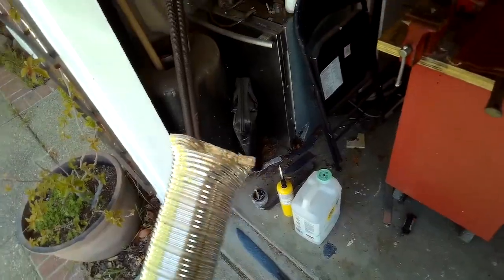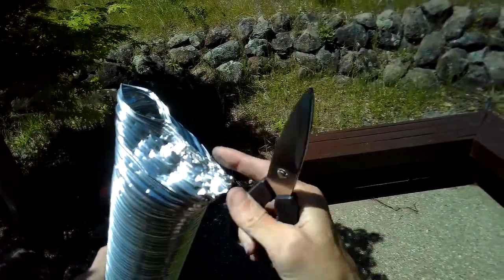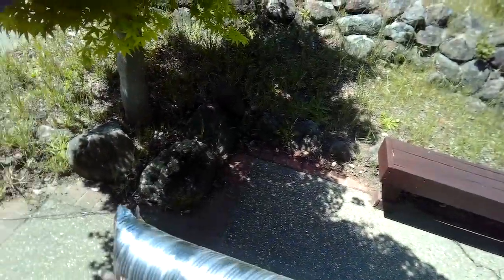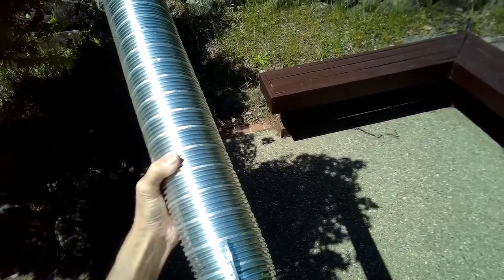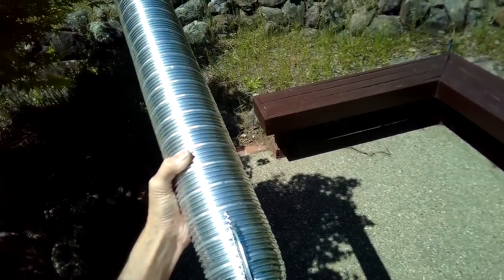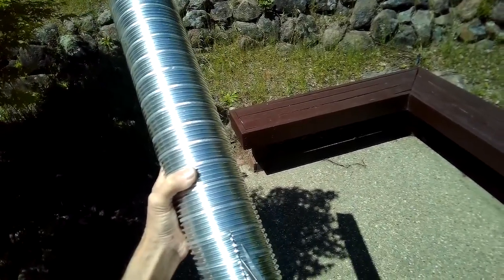I need something to use as a quench tank, so I took some dryer vent tube, turned it in on itself, and crimped it with my pliers. Now I'm going to cut the top so it's open — it'll act like a trough for my oil. It's kind of cool because it's somewhat adjustable; you can make it longer for a longer weapon. It won't catch on fire, and it's super cheap. I just have to figure out a way to support it on its sides.